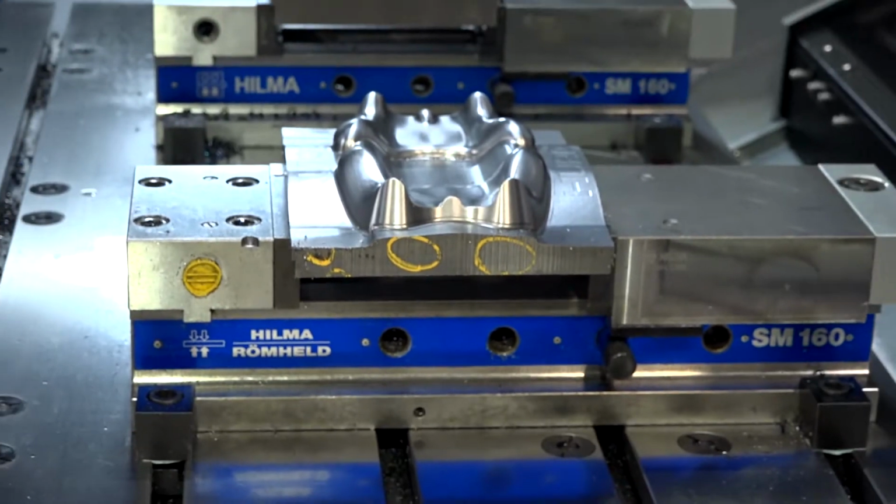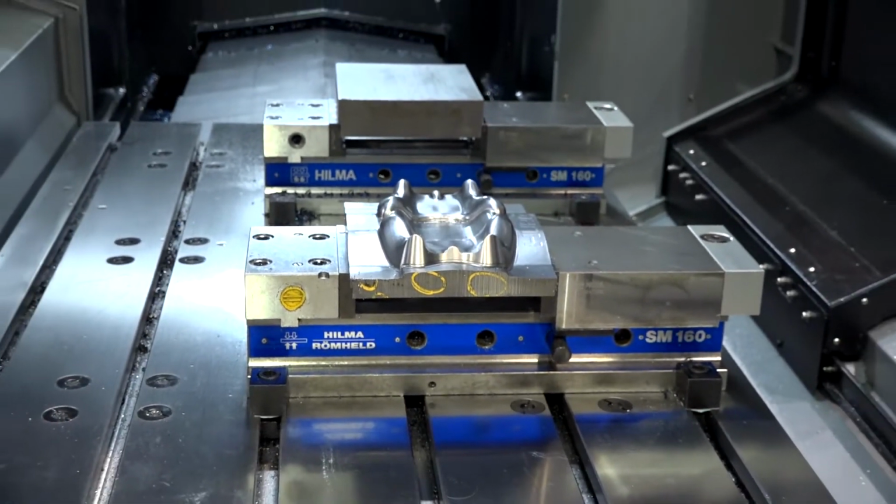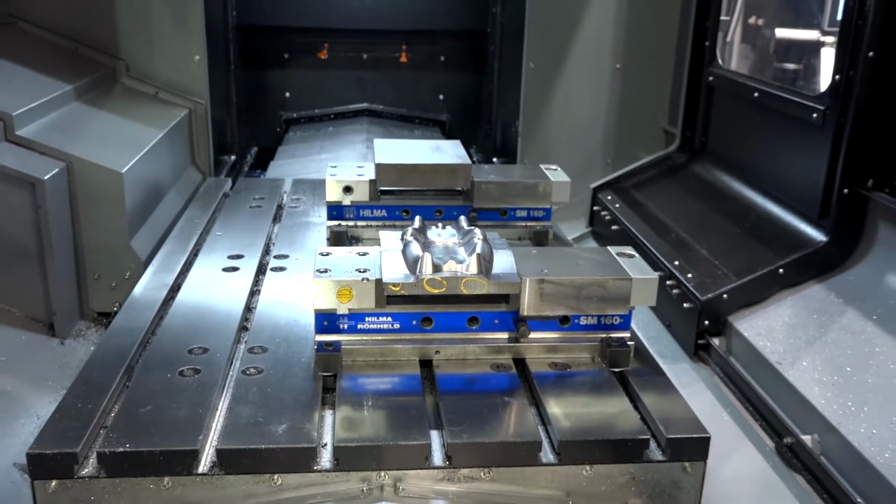And again, key to it is saving a lot of time, because you're doing it on the machine. I'm looking at this one here, for example, 2 meters by 1 meter on the bed? Yes, that's right. So on a large machine, especially 5-axis, we'd level over 9 points. With a large table such as this, you'd be climbing in and out of the machine, checking the levels in both directions, then having to go down and work around the machine.